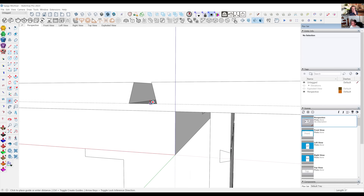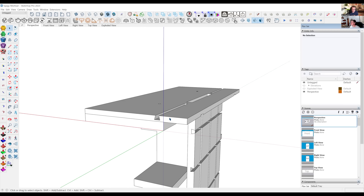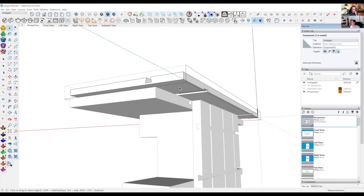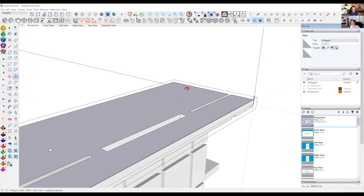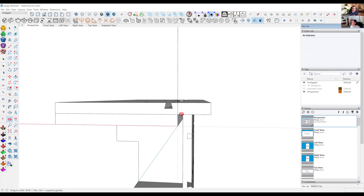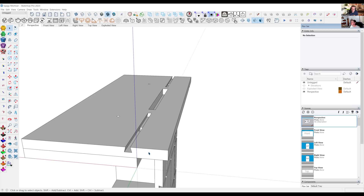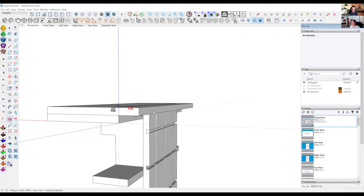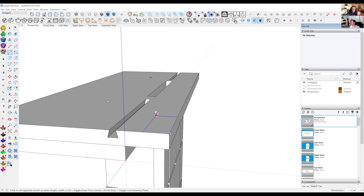The top is still half inch and that runner is an eighth — is that going to work? I think we have to be careful about deformation. I don't know if taking that much away and only leaving an eighth-inch skin, especially in the zone near where we're routing, is potentially problematic. I'm okay bringing that back to three-quarters, keeping it in the back of our minds if there's any alternative way to come back to a half-inch top. Otherwise we'll just stick with three-quarters. The stops would then sit right on top — no reason to use quarter inch when everything else is three-quarters, and I wouldn't want people to have to buy another sheet of plywood just to make a flat stop.